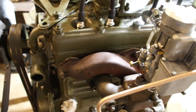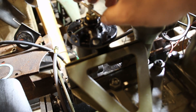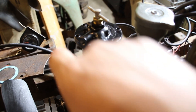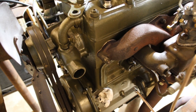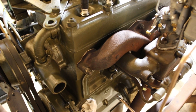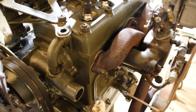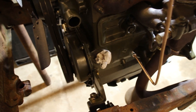After 30 minutes of run time on that break-in oil, drain the oil and usually change the filter. On this one, you just turn that a few times to drain the barrel, then fire it up on Shell Rotella 15W-40 diesel oil. That's what I run in these engines from the time they're brand new onward.